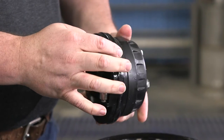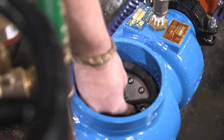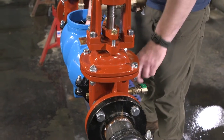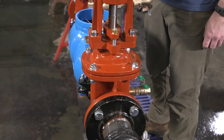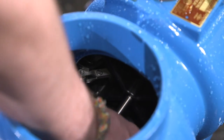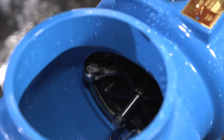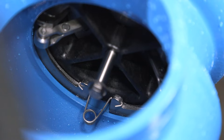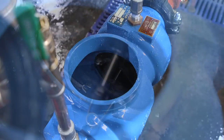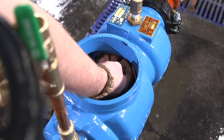To reinstall the check valves, begin by lubricating the number 2 check valve o-ring. Install the number 2 check valve in the body. Close the number 4 test cock to hold it in place. Install the butterfly retainer clips by inserting one half of the clip into the body groove to anchor it in place. Next, pinch the sides of the spring together and rotate the second half of the clip into place in the body groove. Repeat these steps for the second retainer clip.